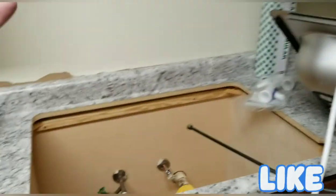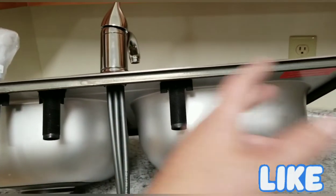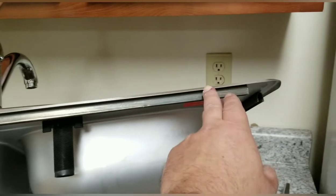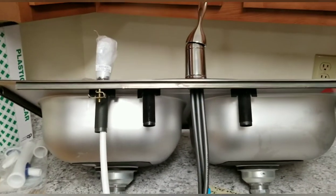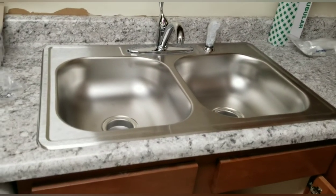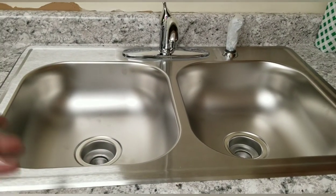Before we set the sink in its place, we're going to slide some anchors into the rails. For the double bowl, I'll put about two or three on the back — one here, one through the middle, one through there — and about three on each side and four on the front, depending on how many come in your set. Make sure they're evenly spaced because those are what secure your sink to your countertop. Once that's done, go ahead and drop your sink in place, make sure everything is in line, then go under and start placing all those anchors up against the countertop and tightening them down.